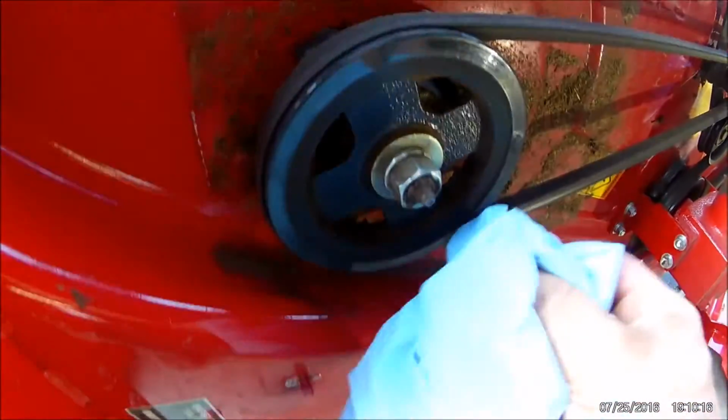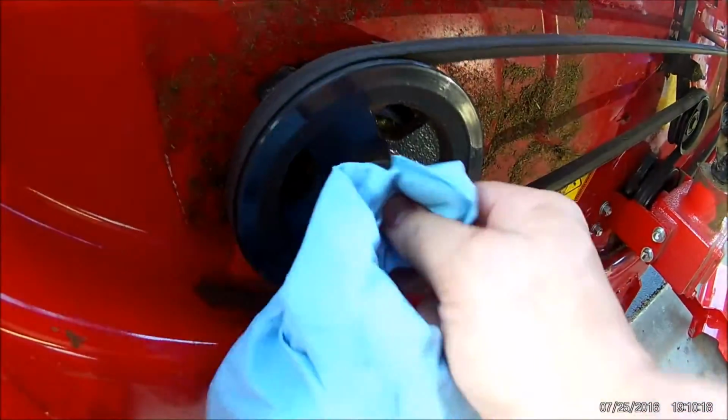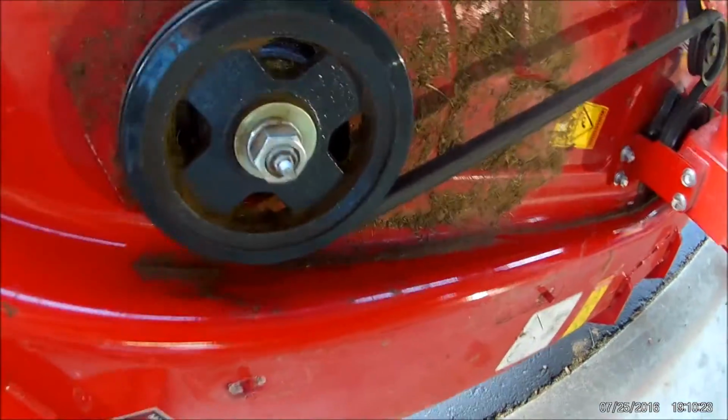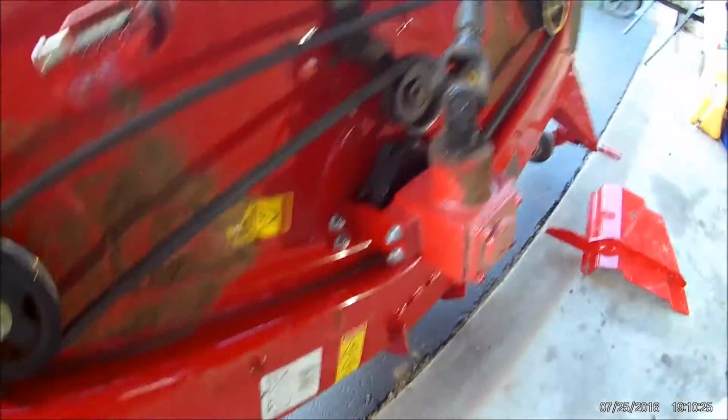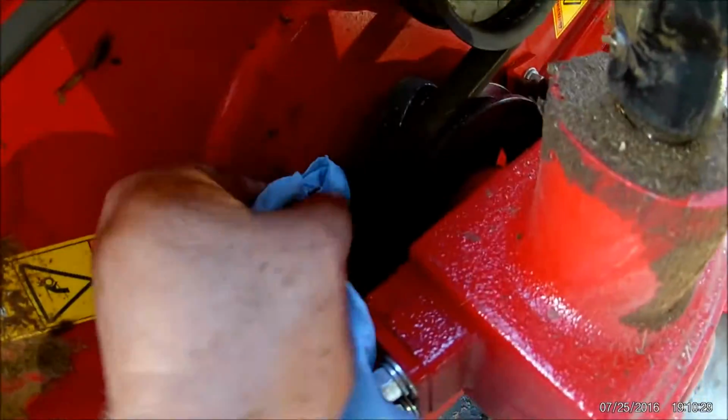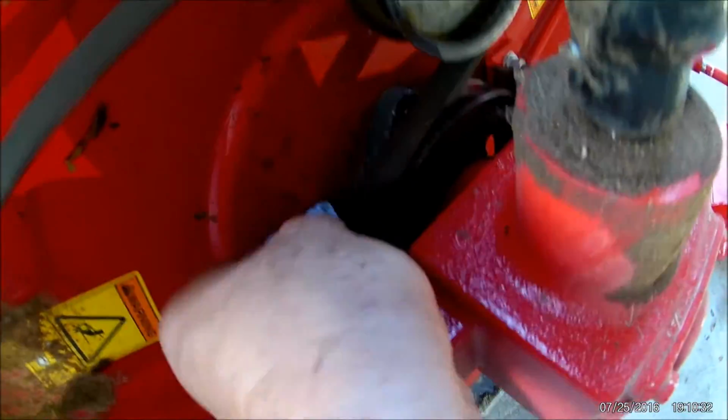It doesn't matter if they're really that clean for open ones, like bucket pins. If these bearings right here, these grease fittings go to needle bearings. So you gotta make sure you clean these off. If you don't, when you grease them, you're going to push dirt right into those needle bearings. And that's a guaranteed failure.